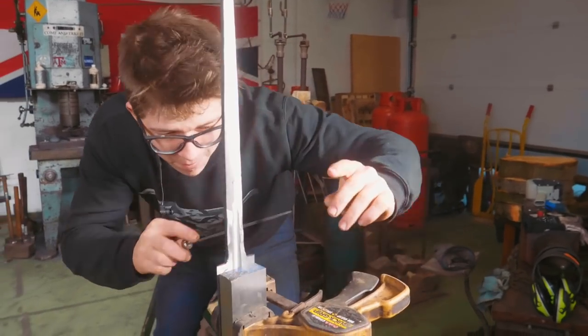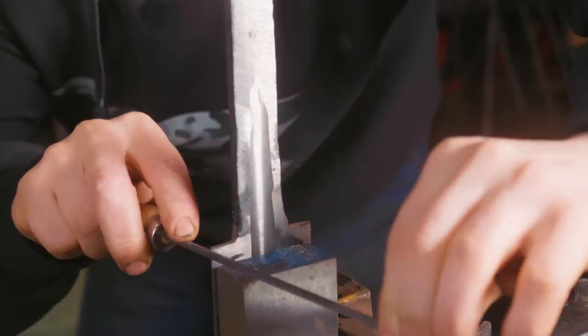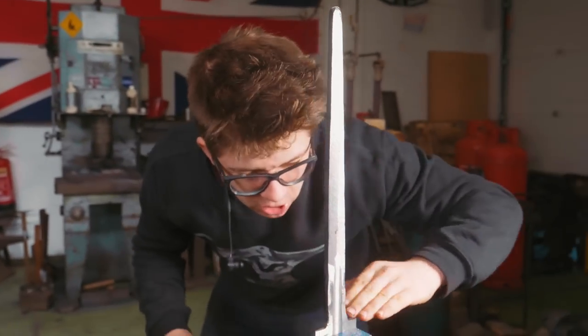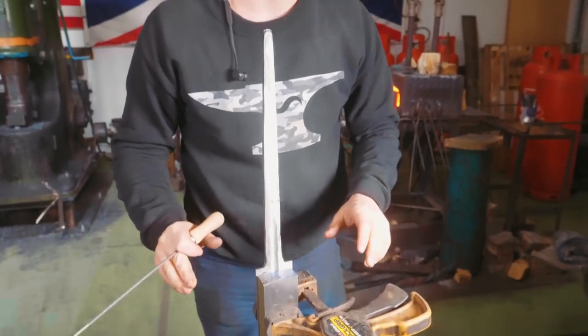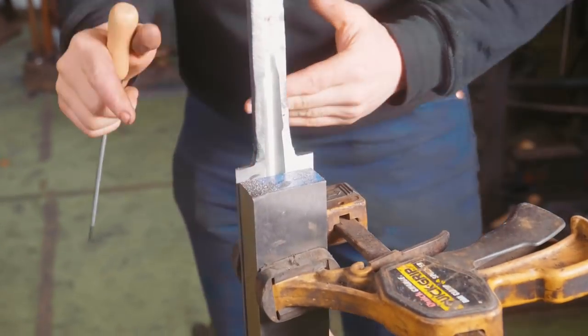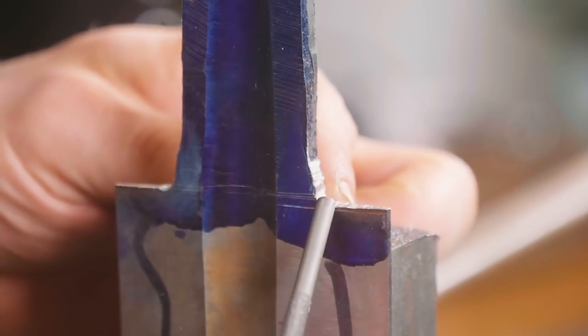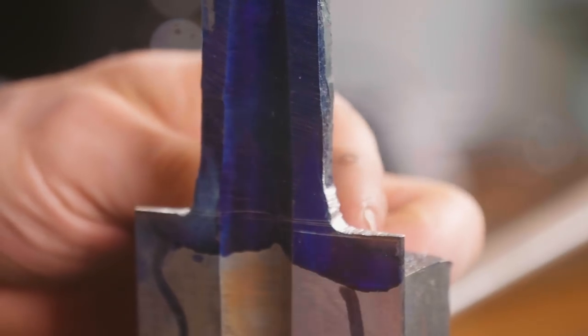So after many, many hours in the grinding room, here I am after having scribed a horizontal line. I'd already done this before I made the fuller, but silly me, I then ground the bevels before getting the tang shoulders set. That's what I'm doing right now. It's too wide for me to be able to use a carbide file guide that I can just clamp up and then file to. Instead, I'm just gonna be working to scribe lines on either side.